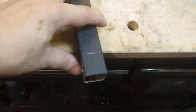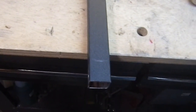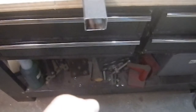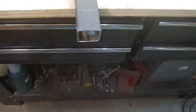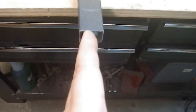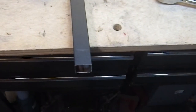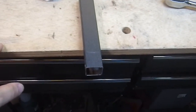I find clamping things to the workbench is actually a little easier than using my vise, because this position lets me hold the angle grinder with my arms against my torso, giving me a lot of control to make a nice easy cut going in with a lot of precision. If it's up higher I don't have as much control. So there are times I use the vise and times I use the workbench surface. Funny about that — a workbench has a surface that's a good working height.